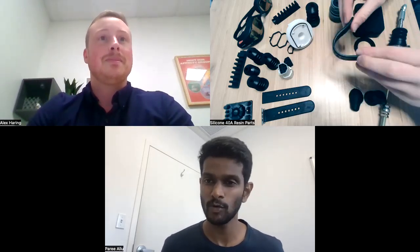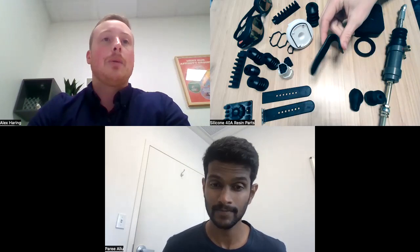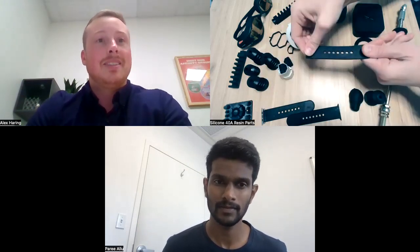That is very exciting. Alex, could you tell us a little bit more about what the key properties for this silicone 40A resin are? So as the name implies, it's a 40A durometer material, which is quite a soft material, but it's actually still pretty tough. We get over 200% elongation at break, a five megapascal tensile strength, and a tear strength of 12 kilonewtons per meter. So it's soft, but you're able to stretch it, pull on it, and it holds up quite well. It's got good rebound properties — 34% rebound resilience — which means it snaps back into place when you let go, just like a rubber band would. Or if you drop it on the ground, it's going to bounce, as you'd expect from a piece of rubber. We can see our colleague Alina showing us some of those silicone parts — the stretchability and the tear strength. Super impressive material.